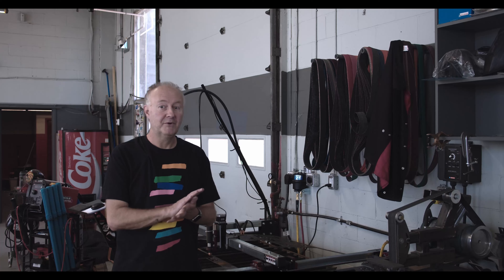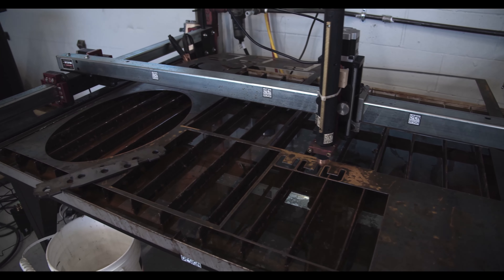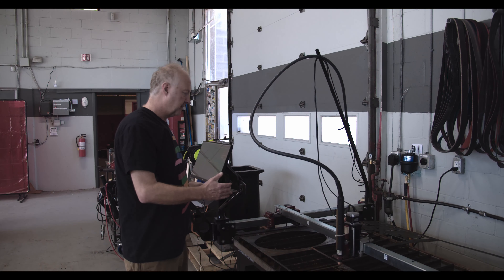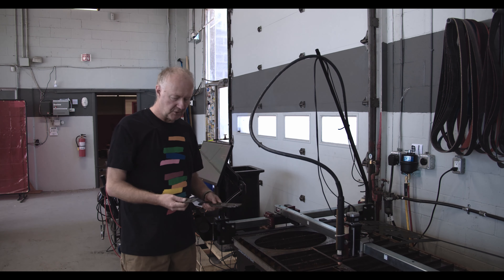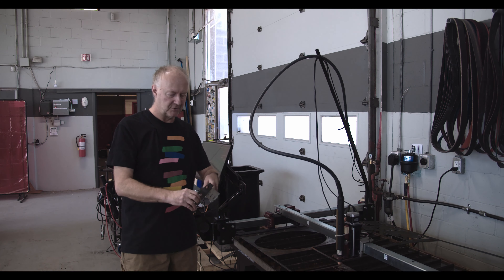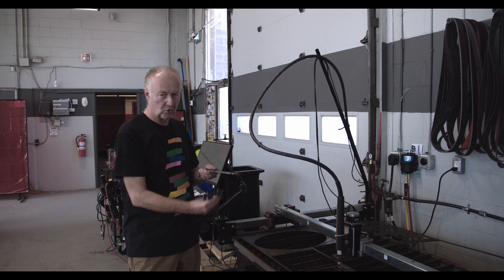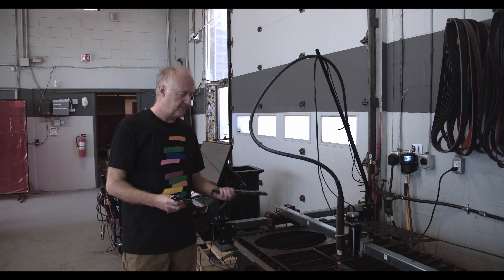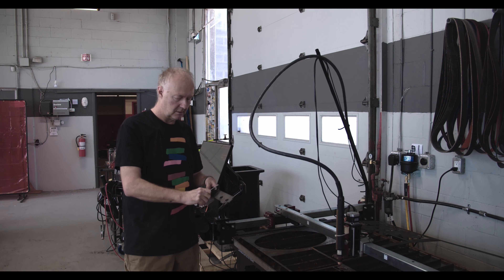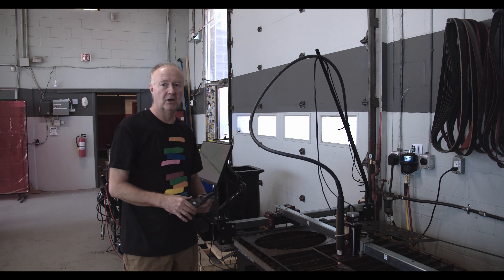One of the most exciting new machines in the shop is a plasma cutter from Langmuir Systems. One of the big projects we're going to be doing on it is a welding table — probably about four feet by two or three feet. We've been working on the spacing, how big to make the tabs and slots, and just making little test pieces. The fixture holes will be in there with braces underneath joining the top and bottom plates. It's amazing how you can come up with a design, come in here, cut it out — this is 3/16th steel, heavy heavy steel — see how things fit together, fine-tune, and then just have the job go.